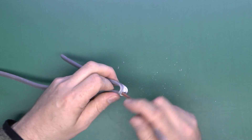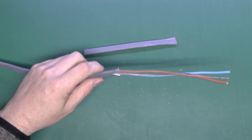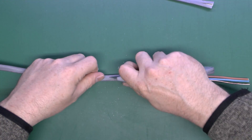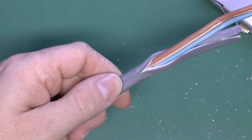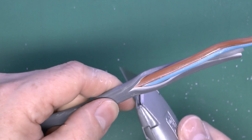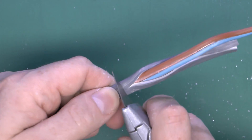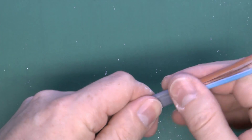Much easier to check before rather than after you've stored hundreds of metres in somebody's building. To get a clean cut end, cut another piece as if it were the start, then score the outer covering on both sides of the section you want — but crucially don't go all the way through the insulation, as that could damage the inner conductors. Then pull it down to a point and tear it away, leaving a flat, tidy end.